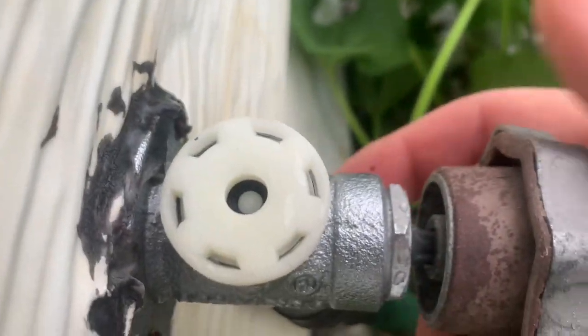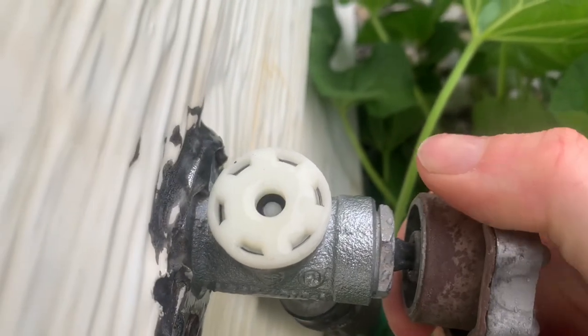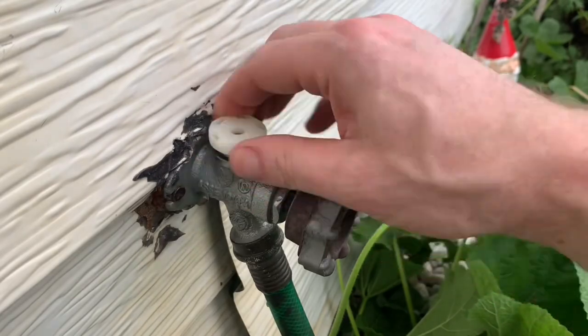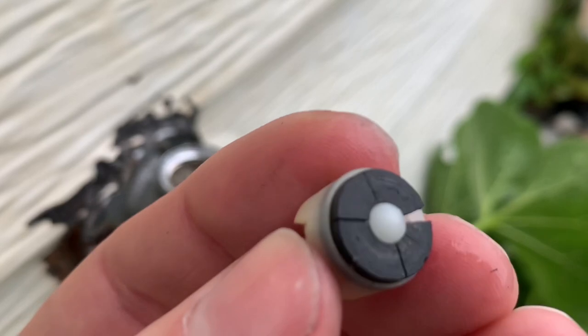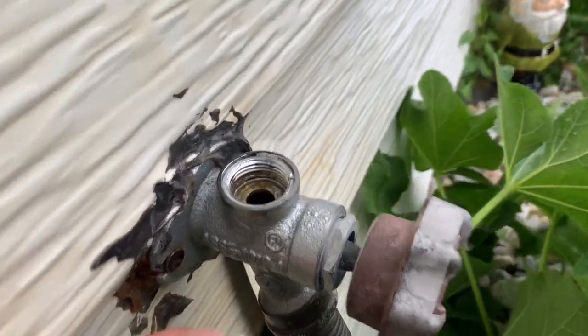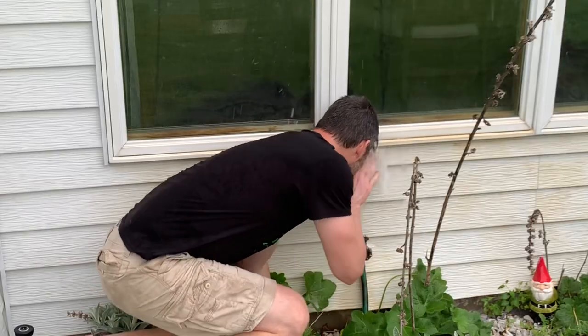This one pops up to close with the water on, but it doesn't seal and water is squirting out everywhere. Use some vise grips or channel locks to remove the vacuum breaker — it is threaded and just screws out. With the vacuum breaker removed, here is the plunger inside. The seal is broken and cracked, which is why water is leaking. Here is a look at the faucet with the vacuum breaker removed, and let's turn it on for completeness.